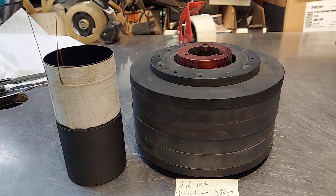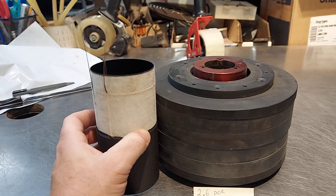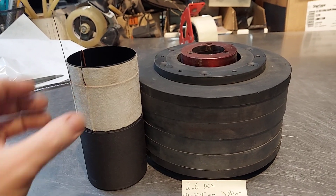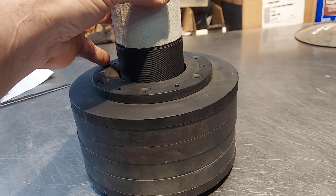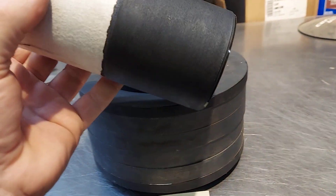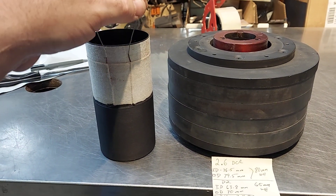The basic reason why coils burn is they get too hot. Now that sounds a little silly but that's actually the truth. What happens is when it's centered in the gap, the more time it spends out of the gap either direction, this thing is going to get hot. If you put a DC current to it, it'll get hot.